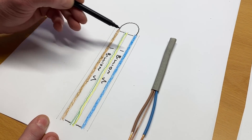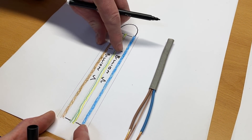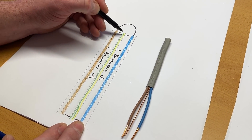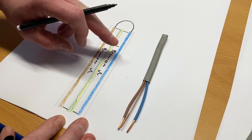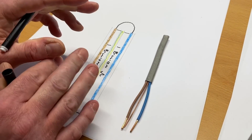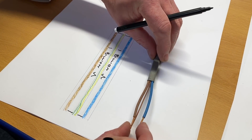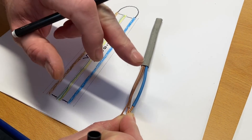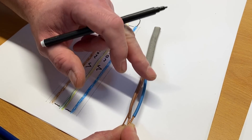When you carry out the test with line and neutral linked together to the protective conductor, the resistance in each conductor is in play at the same time. With both at 1 billion ohms, they are effectively connected in parallel — so the overall insulation resistance won't be 1 billion ohms, it will be lower. By connecting live conductors together and testing them to the protective conductor, it's a more onerous test: both conductors are tested to the protective conductor simultaneously.